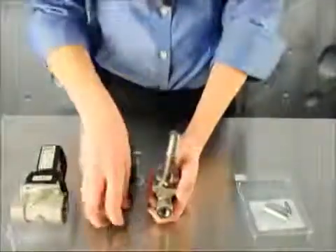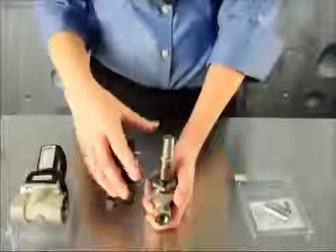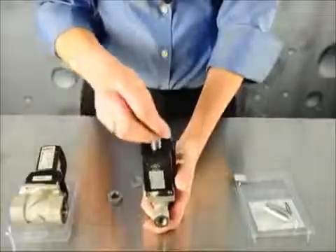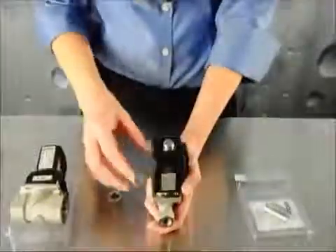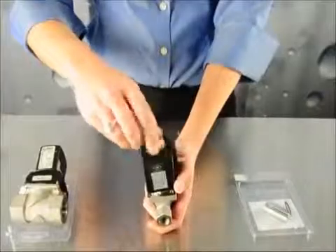Finally, put back on the O-ring that is provided in your repair kit over the plunger shaft, and then place the coil back on into your desired position. Put the seal nicely back, tucked inside, and follow with the washer and the nut, and you've just repaired your Type 255 valve.